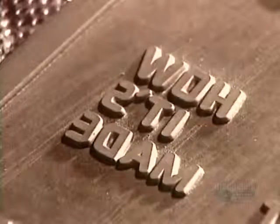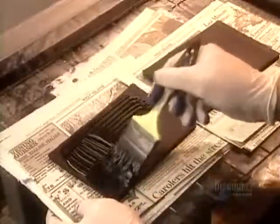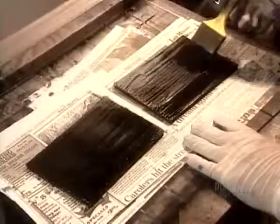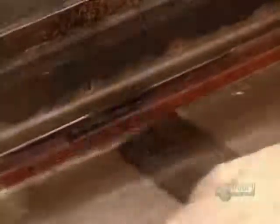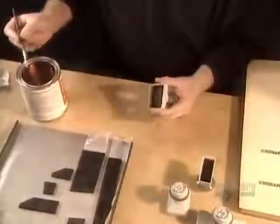Next, it's set out to cool for another 45 minutes, this time on newspapers, which soak up more excess ink. Finally, they wrap the mold in paper towels and newspapers and vacuum out the last drops of excess ink. Then they quickly seal the back of the stamp to lock the ink in. Now they can cut apart the individual stamps and glue them by hand onto the base of the stamp handles.